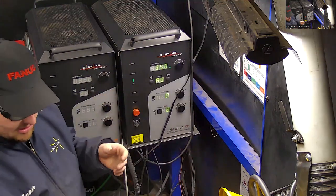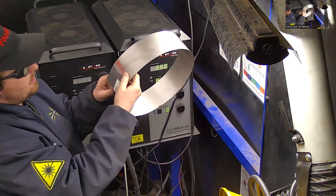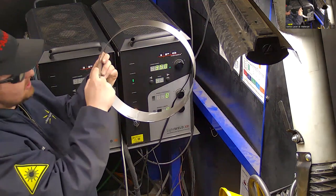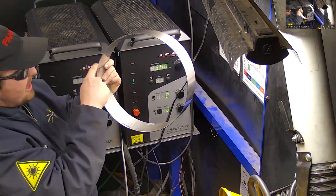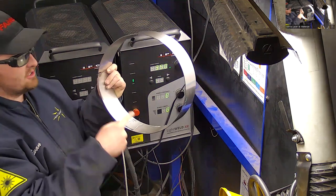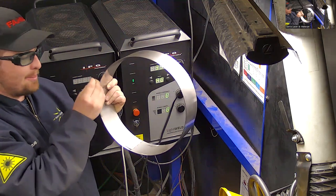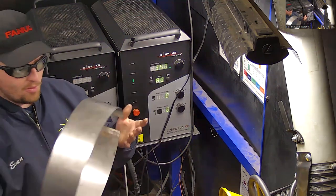But what I noticed when I was playing with this is that when this ring is brought together, because of the end of this, where this part was rolled, the end is a little bit straighter. It doesn't have the curvature to it. It doesn't sit right on that ring. So if you wanted to fuse weld that, you'd probably have to tap it into place to bring that gap down and then fuse weld it. For any little gap, you're going to want to use the wire.